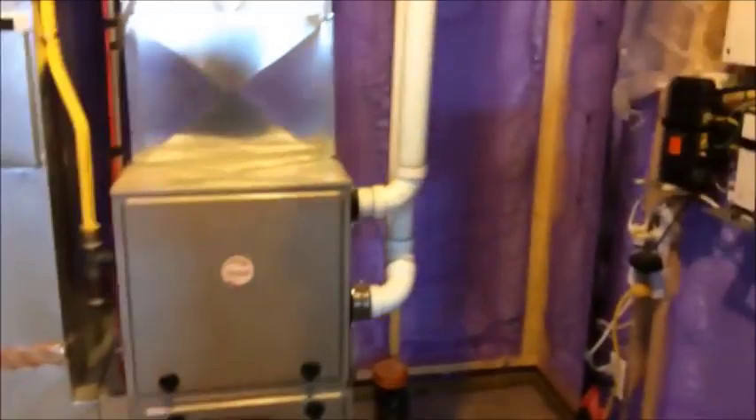Just take a look at this mechanical room — this is the difficult area of the whole job. Getting behind the plenums, getting behind the furnace itself, getting tight to the electrical panel but not overspraying everything, getting foam behind the water heater but not all over it. You can hear my guys wiping everything down to make sure it's clean and crisp. Static electricity holds the foam shavings. The foam is not into the wires — go check that video on how a bad job brought the spray foam right up to the box; there's nothing you can do with that. Here, they've got a lot of room to add or remove wires.